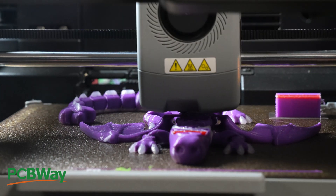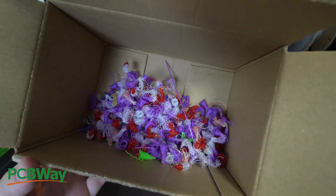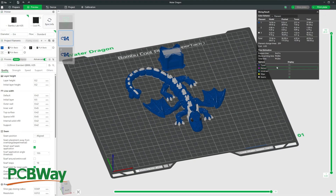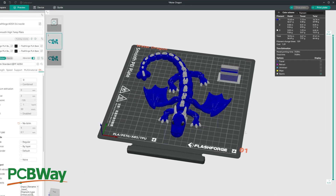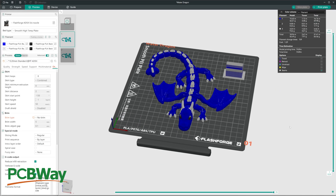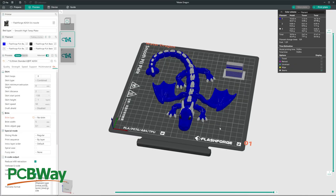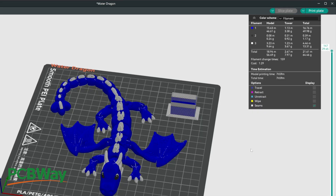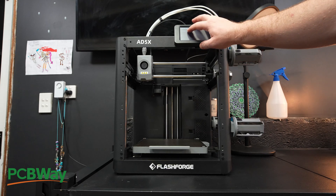There's something about this workflow that really bothers me: all this purge waste, and I have no idea how much filament it actually represents. Look at this — the same model in Bambu Studio shows 9 hours 25 minutes and tells me exactly how much filament it's purging. The Flashforge slicer? 7 hours 56 minutes, which is actually faster — great. But there's no purge calculation anywhere; the column is just completely missing. It turns out purging on this machine is controlled by the printer firmware, not the slicer, so the slicer can't calculate the waste. You don't know how much filament you're wasting or the true cost of your print. For someone trying to run a side hustle or manage material costs, this could be a real deal breaker.